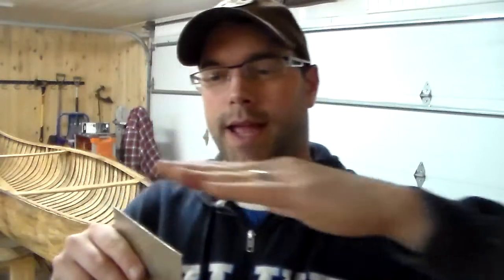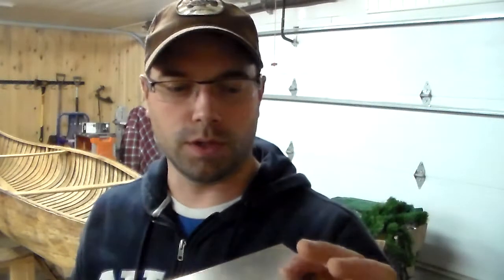This is just a piece of basic sheet metal, that if you just burnish one end, which is just taking a metal file and rubbing it across diagonally, it makes a nice even burr. I always hesitated on trying it because I figured it might be a skill I need to acquire to get that edge proper. And I just tried it, took me 2 seconds. Just doing it diagonally makes a nice even edge. It's the same thing we do as bushcrafters to get that edge on the back of our knives to strike a ferro rod.